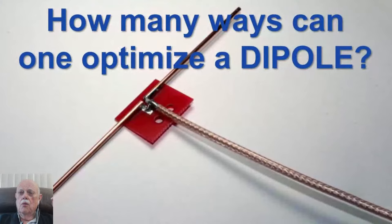We're going to learn how. It's a problem because there's a lot to it compared to most other antennas. Take an ordinary dipole — how many factors are there to optimize a dipole? Really just one: how long you make it. You run the formula — 470-something divided by frequency — cut a piece of wire that long and you've got an optimized dipole. But it isn't that easy for a mag loop. There are in fact six factors to optimize with a mag loop: conductor diameter, the material you build it out of, the shape of the loop, the maximum size, how you match the loop, and how you tune the loop.